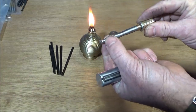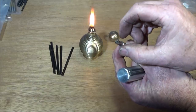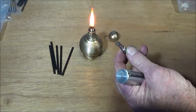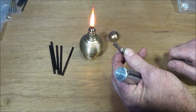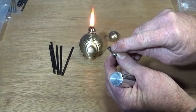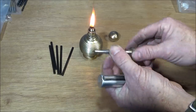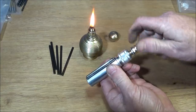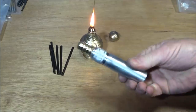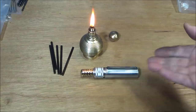And that's a stainless steel rod on there, and it's been bored out the end or drilled out the end, so it's a bit larger than the Swiss file end. You'll see that in the video. The Swiss file's pushed in the end there with a bit of Loctite 638, and there's a bit of a bore around the Swiss file in which you push some lighter wick, or you can actually use cotton wool. So when it goes into the cylinder, it soaks up the lighter fuel and stays wet the whole time. And all the time that you're not actually using the lighter, the fuel stays safe and it doesn't evaporate at all.